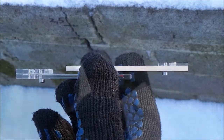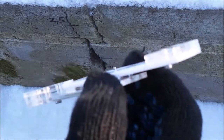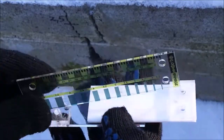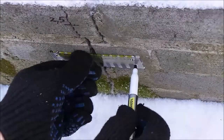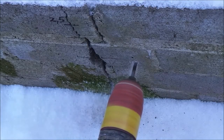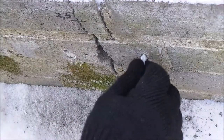The additional brackets must be fixed. Two items of the same width are fixed on both plates of the gauge for crack monitoring to ensure a gap between the lower plate of the gauge for crack monitoring and the surface of the construction. The other bracket is fixed to compensate for the difference — the shift from the plane, the size of which was measured earlier. Its width is chosen considering the size of the gap between the plates of the gauge for crack monitoring, which was identified when fixing the plates with the help of assembly screws.